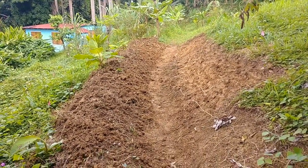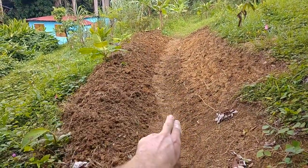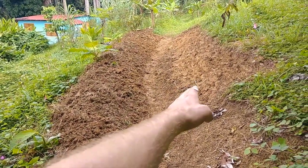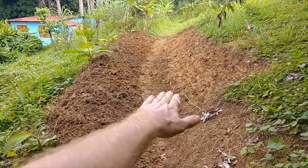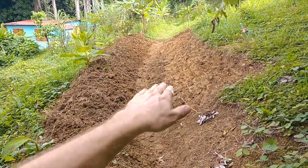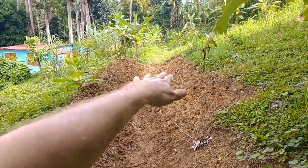You can see here we have a nice level flat area, but it's only about a foot or two wide, so we're going to end up cutting further into the bank just to create a nice level area at the bottom. Then we're going to use an A-frame level across contour all the way up there to make sure that as we go, this swale is perfectly level or has a drop of very slightly about one percent grade.